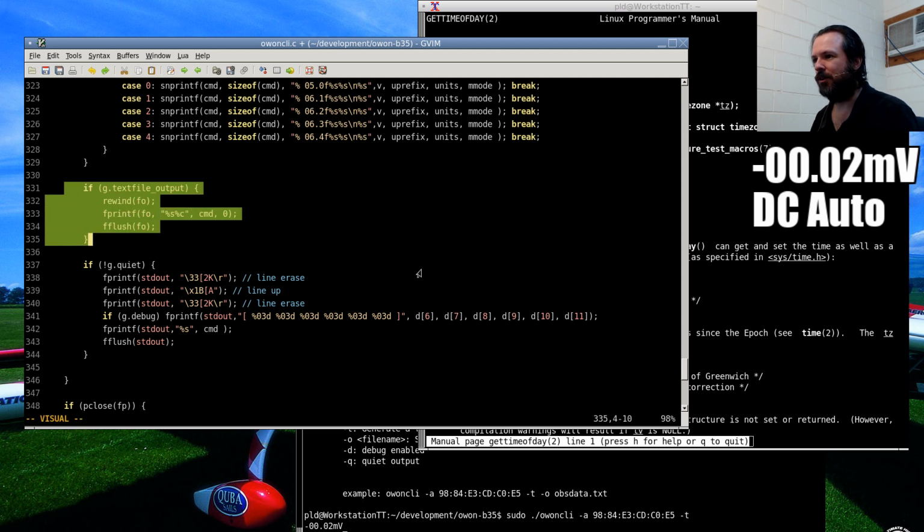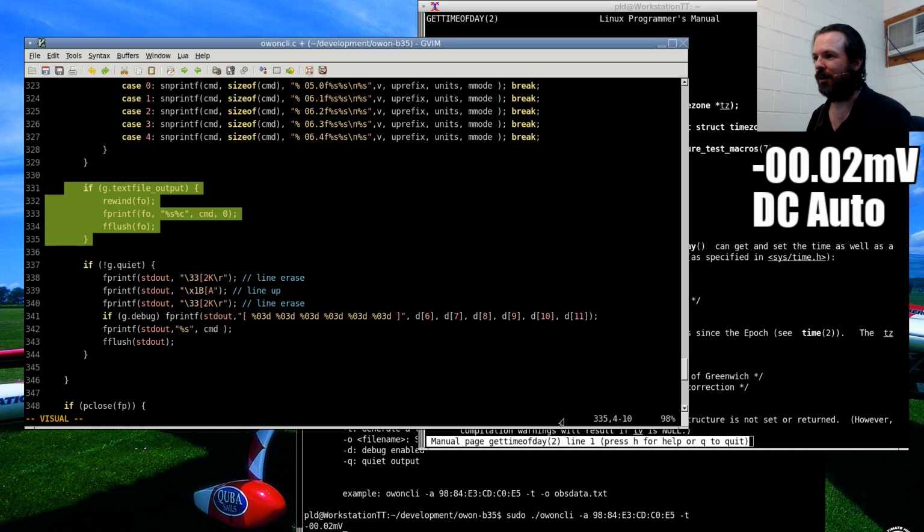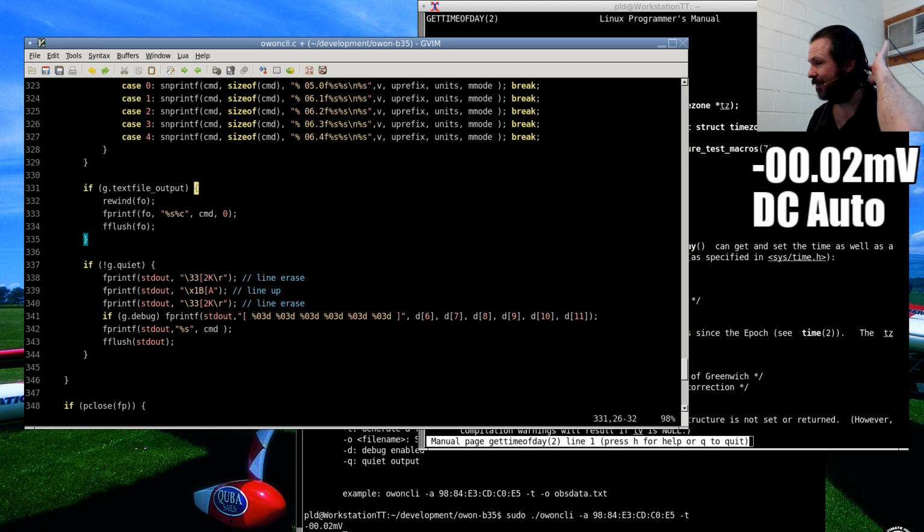Anyway, this bit here is the one that generates the one for Open Broadcaster. Hey Vladimir. The reason why it's only Linux at this point is because I haven't found a nice, easy Bluetooth Low Energy template, so to speak, to be able to get the notification data that I need to do the decoding. If I can get that notification data in a fairly easy way, then it's easy enough for me to apply this decoding program to it. But getting that information in Windows, particularly Windows 7 or 8, doesn't appear to be too easy at the moment. They left out the whole API to do Bluetooth Low Energy. Standard Bluetooth they have, but not low energy.